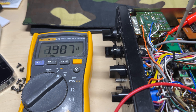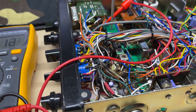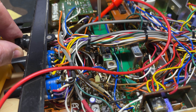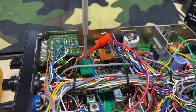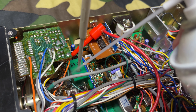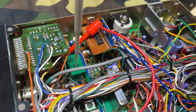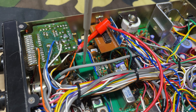So we're injecting channel one high band and you can see the VCO voltage is all over the place. Really bizarre — and then it'll just clear and go right again, and then it just goes again. So I'm thinking maybe it's dirty VR1 or VR2. I'm still not convinced about C11, because I know that's supposedly a troublesome capacitor and it hasn't been changed in this radio. So maybe C11 is the problem.